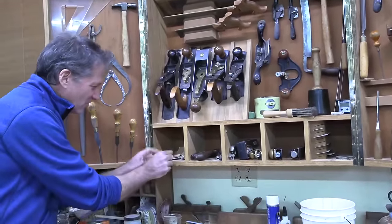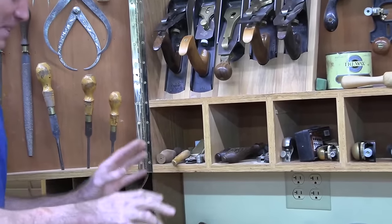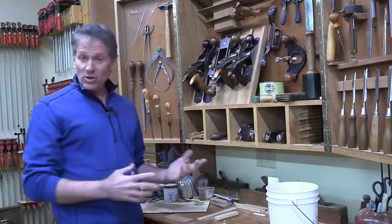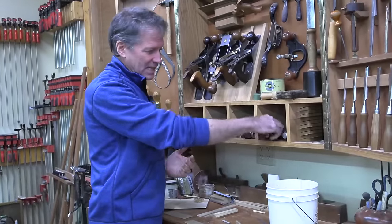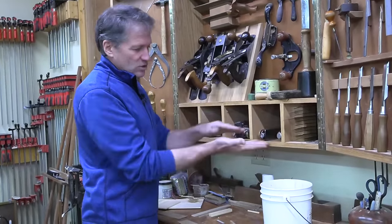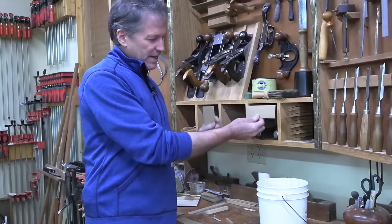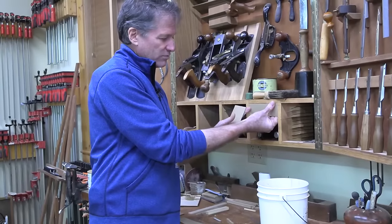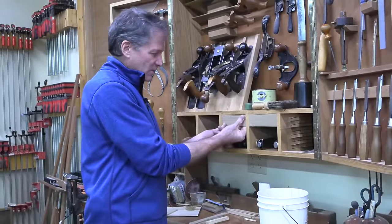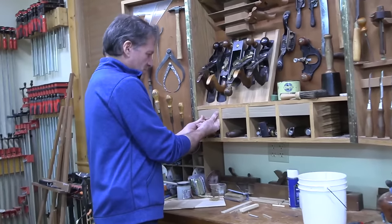I've got these little odds and ends — like a feeler gauge, some extra handles, some brass ferrules — things you need, but they're cluttering up. So I'm going to put some drawers in here. I want them to look good and be functional, but also not inhibit my hand getting in to grab the plane or whatever it is. I don't want them to come down too far in this space, so I'm going to put them in the top level. I started out thinking about two and an eighth inch, but when I stuck that in there — I cut a little cardboard piece to simulate the drawer front — it felt too wide. Two inches is what I ended up landing on.